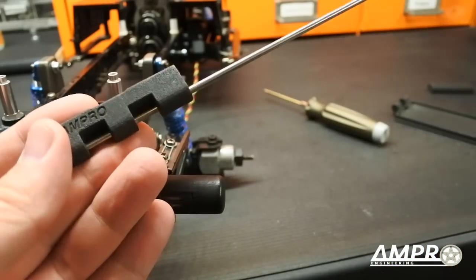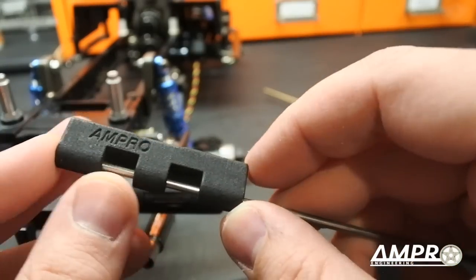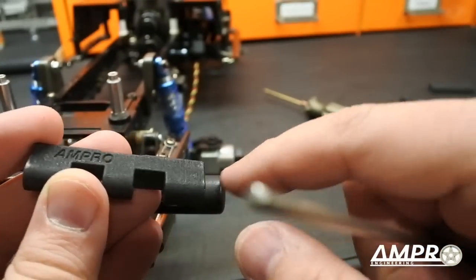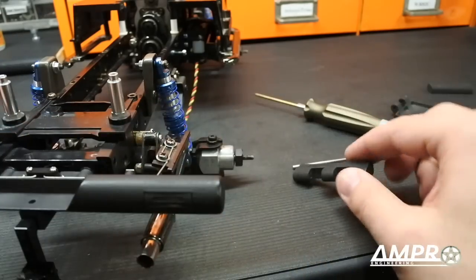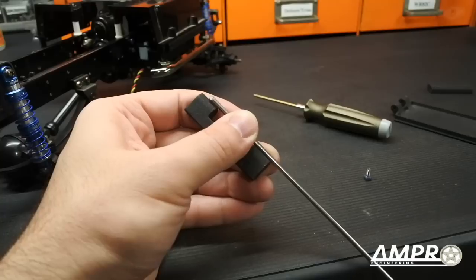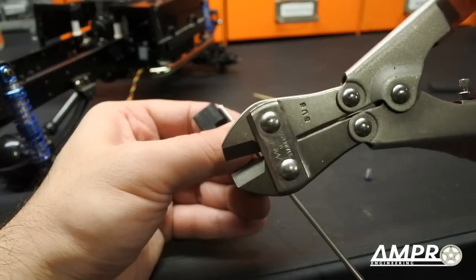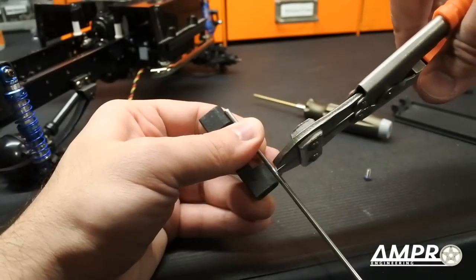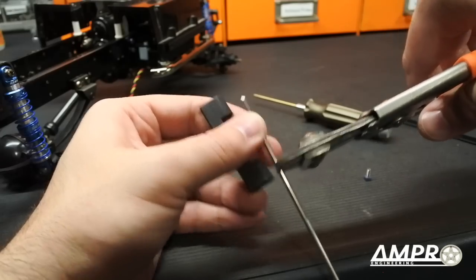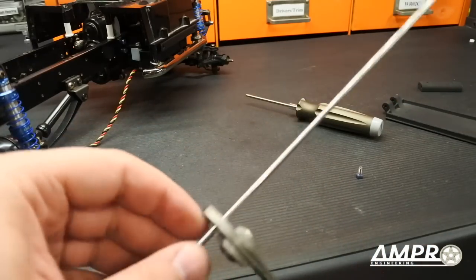Once we place this piece here, I need you to know that we cannot make this as wide as this member here because again we have screws coming in the side to align this. This is going to change depending on what screws you have — I'm using some six millimeter allen head screws. I'm going to place this over the area where I want the hinge pin to reside, and I'll use these little mini bolt cutters — way more useful than a Dremel.